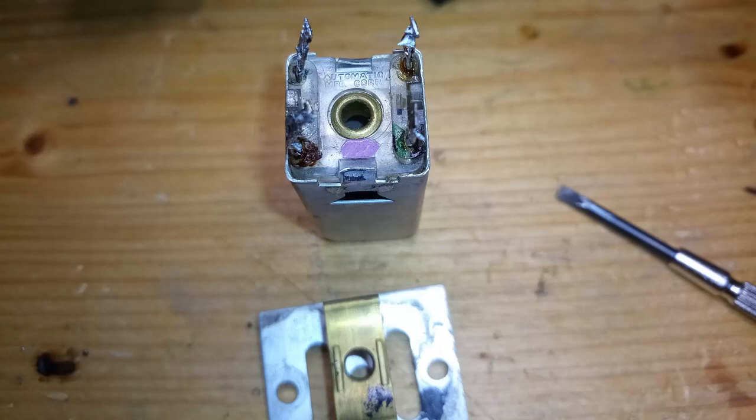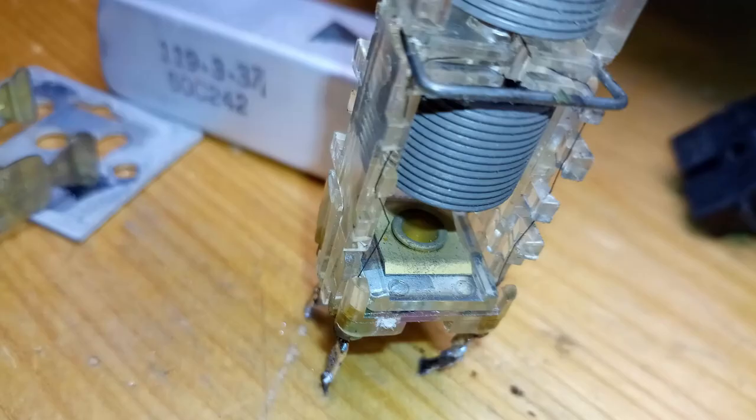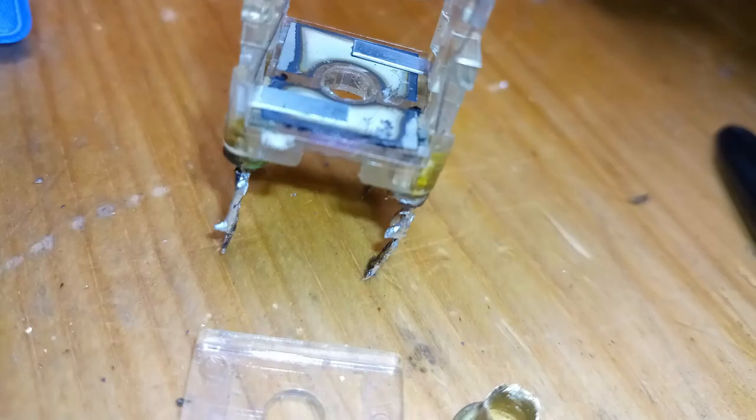The typical mica capacitor is made by a sheet of mica coated with silver and possibly other metals to obtain the two plates. This composition must be protected from external agents contained in the air, otherwise it would deteriorate. In the 1950s, there has been a production of intermediate frequency transformers containing silver mica capacitors with no protection. Since then, almost all of them developed a deterioration that is known as silver mica disease.